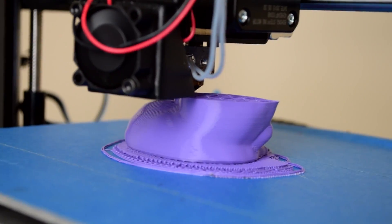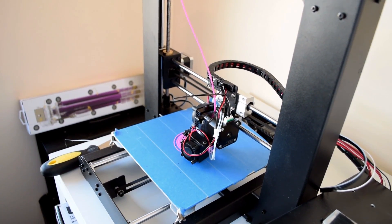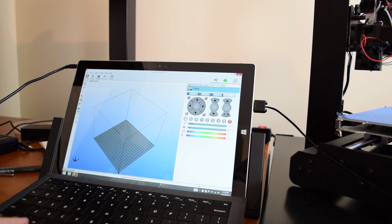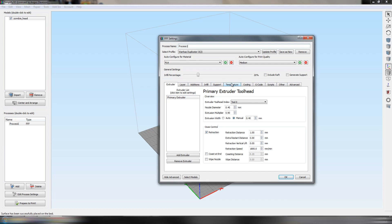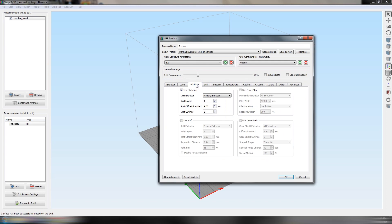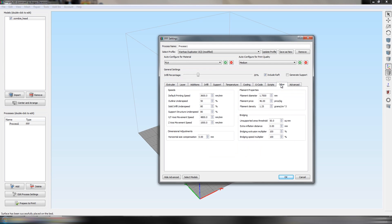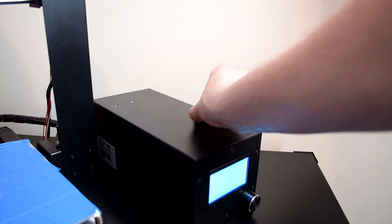As of right now, I've only had success printing in PLA on my Wanhao Duplicator i3, as my machine can't reach temperatures high enough for ABS — though this is probably due to the lack of insulation tape. I completed several prints using Cura and Repetier via tethering, and while it worked fine, I have Simplify3D at my disposal, so I quickly moved to that. The serial over USB speeds are appallingly slow, so direct to the SD card is really the only way to go. Simplify3D has a preset profile for the Wanhao i3; I only modified the extrusion temperature to 210 degrees C for PLA and changed print speed to 3600mm per minute. I got so sick of fiddling with the micro SD card that I sourced a microSD to standard SD adapter, which greatly improved my experience and let me go from slicing to printing very quickly.